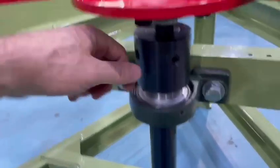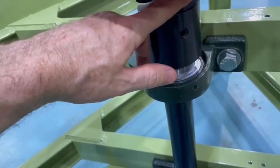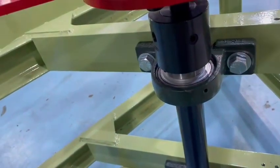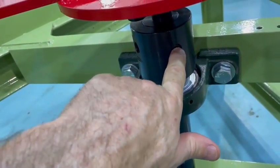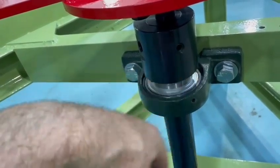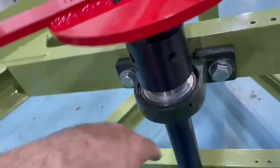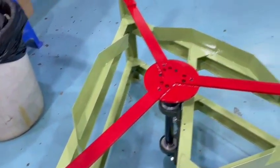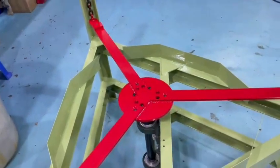This collar here has got locators on the main shaft that set the offset perfectly so that when it's running, the counterweight is exactly opposite of the offset. If these screws ever get loosened, or if somebody takes it apart, changes bearings, and then doesn't put this back on and locate it properly, then you're going to get excess vibration. If you're getting excess vibration with the R1M, you do not want to run it in that condition — find the cause and resolve it. If you run it with excess vibration, it's going to tear things up.